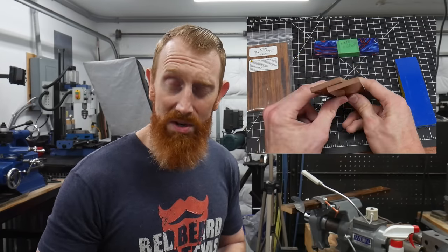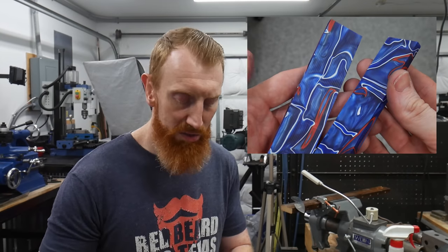I would highly recommend for your first knife using a naturally stable wood like ironwood, or a material like canvas micarta, which comes in a nice flat sheet and is easy to work with. You can also use materials like G10 or Kiranite, but I would probably not suggest either of those on your first build. I'll be using Kiranite for this build because I have some pieces lying around my shop, but it can be a little bit brittle — it does polish up nice and shiny though, which is why we're using it here.